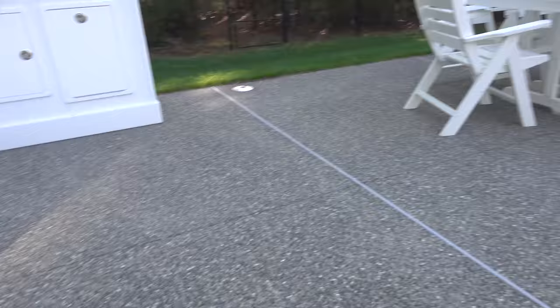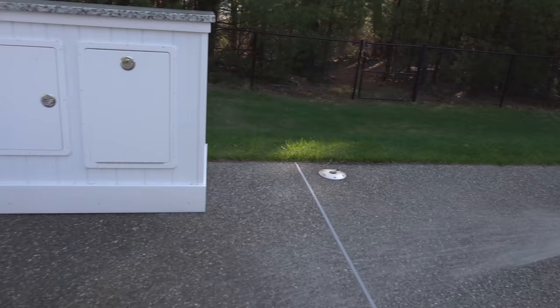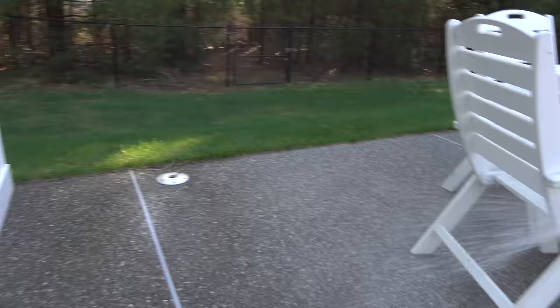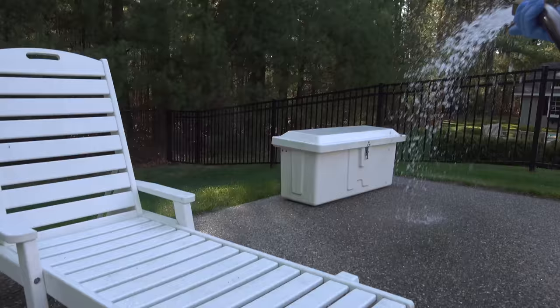Since I'm going to be spraying ground-level stuff, I'm going to leave the red plug in place — that gives me more of a spray pattern to apply this stuff evenly. One trick you want to be aware of: this is a bleach-based cleaner, which is great for killing mold and mildew, but you don't want to damage your grass or other plants. Just spray plain water on anything you don't want to clean, so if any cleaner gets on them, that extra water will dilute it and shouldn't cause any problems.